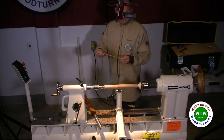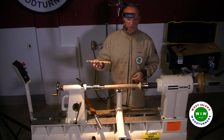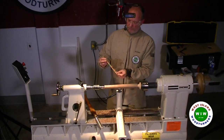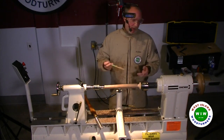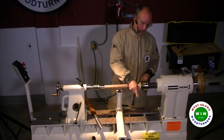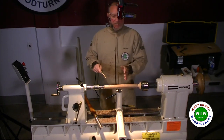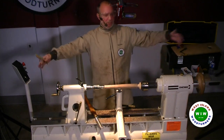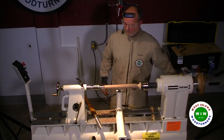Well, problem averted. So, if you're making it repetitively, just make yourself a quick and dirty jig to check things, right? A go, no go. This one, you can see I got several sizes on there. I used to divide it up into three so that I could check my sections a lot easier. As you get the hang of it, you can get your angle a little bit better. Mostly I'll check just the end one, the front one, every now and then one in the middle, just to make sure that they're all the same diameters, because if you're holding them together, you can tell if they're not the same size, right? Once they're assembled on a big table, you'd never see, but you certainly want them to start off at least looking the same size if somebody is actually checking their work.